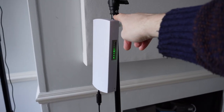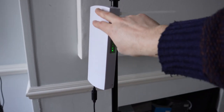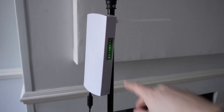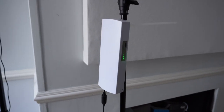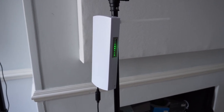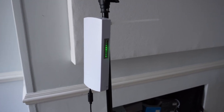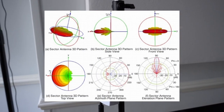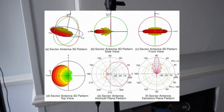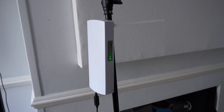This has an antenna gain of 14 dBi. I'm not absolutely certain of the antenna inside — I'll probably take it apart in a future video — but I'm guessing a patch antenna or a sector antenna, probably a sector antenna, to create a fairly directional signal which can be picked up by the other end. That means it's going to be very directional on the horizontal axis and will have pretty good noise rejection, so your noise floor is going to be nice and low and clean.